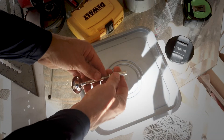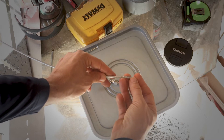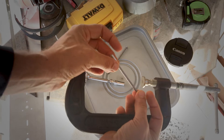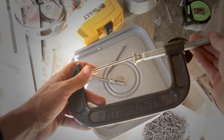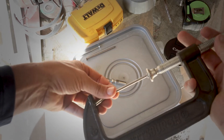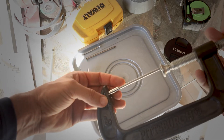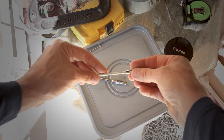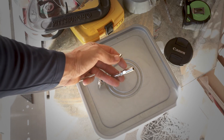One problem I ran into: when I tightened the original lag bolts first, I compressed the fitting enough that I couldn't get the cable through. To fix it, I used a nail to pry the fitting open slightly, working both the top and bottom, just enough to expand it so the cable could pass through. That worked — but the takeaway is to not compress these fittings until your cable is in and ready to go, because they're not very forgiving.